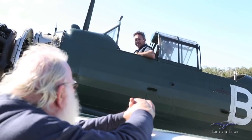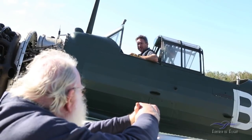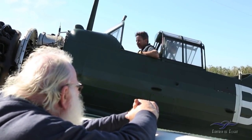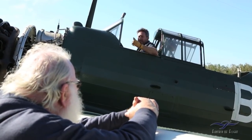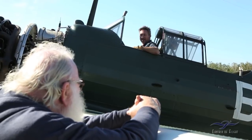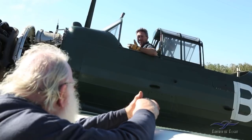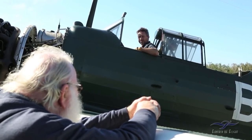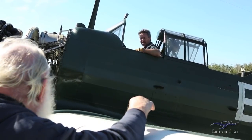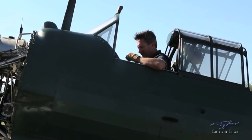Turned and driven off. There's a little bit of a vibration in it. I don't want to run it up too much because I don't have any brakes. Mags checked out fine. It switched off, it was shutting off. Started beautifully. It's strange that the engine driven pump, I mean, that thing should be picking up and just going to town, you know?